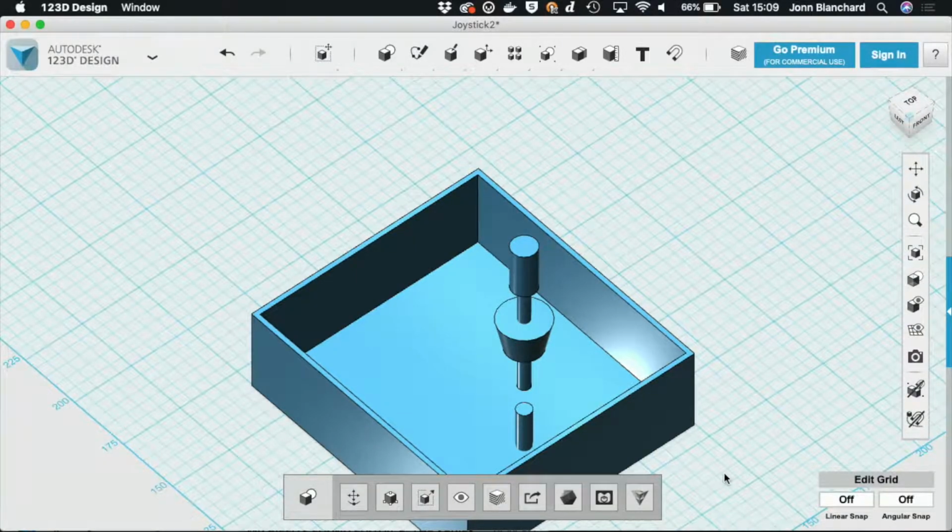I think what we'll do is we will probably add a hemisphere to the bottom of that post and cut out a hemisphere on the bottom peg as well, just so it's got something to kind of move against. Although it's going to be 3D printed, it's not going to be great. The better thing to do would be to have holes cut out of both of the pegs and have a ball bearing of the right size in there, but we're not going to do that. So yeah, that's the changes we have to make to cope with these springs. I will try to find the link to these springs on eBay. I will put them on there.